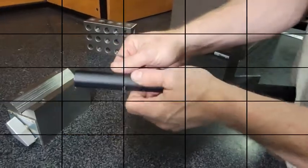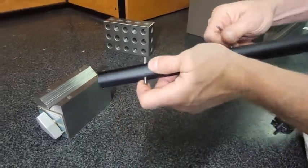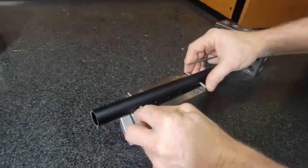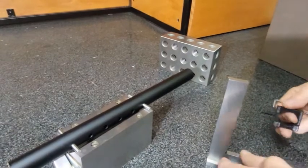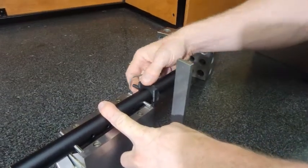You need to align the part for the perpendicular hole, and I'm just going to use my v-block to get this lined up. Right now we're going to be putting a hole somewhere in this area, and I need to put in the machine some kind of reference.